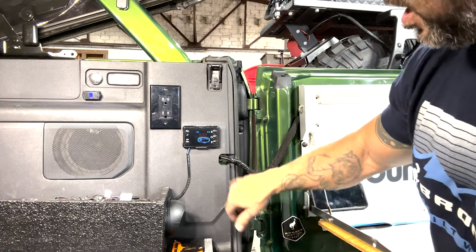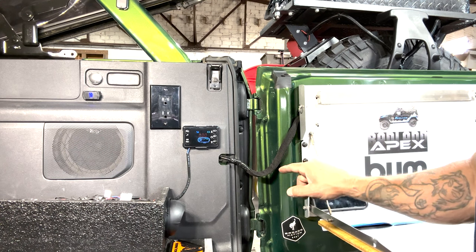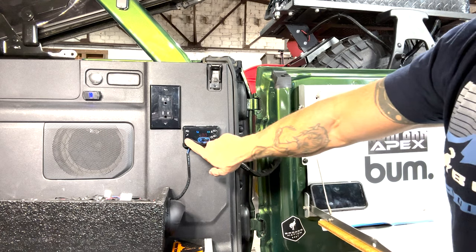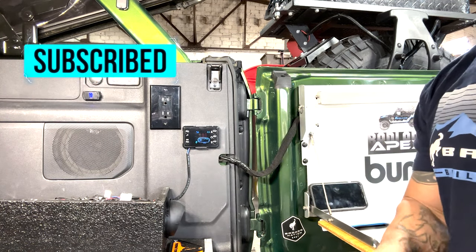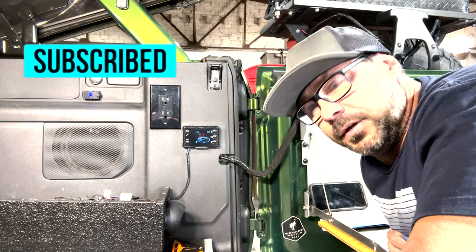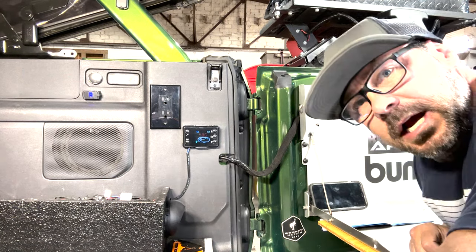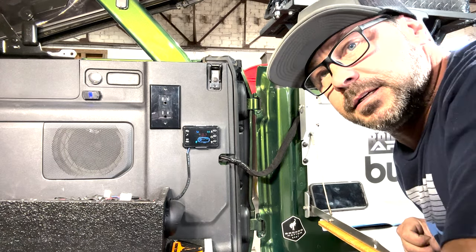And I just did it for 100 seconds, and I can tell that there's still air bubbles in the line. So I'm going to go ahead and do it again like that and hit okay. And then it starts again. Because again, you don't want to start the burn chamber without it being properly filled. And so basically what you're doing is watching it. I'm talking to you guys now, and in a second I'm going to get down there and take a look and see what it looks like and how close it is. Okay.